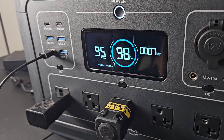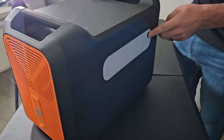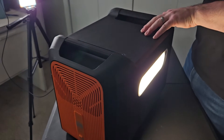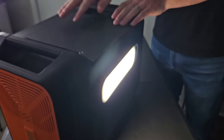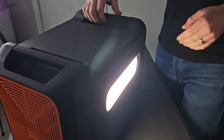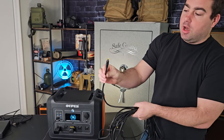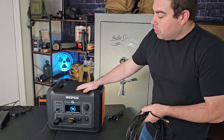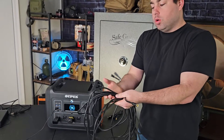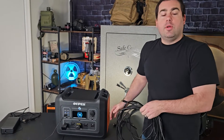It's really good to have a lot of outlets for maximizing efficiency. Another cool feature is the built-in light on the back. I like having a light on the actual solar generator because it's more efficient than plugging a separate light in and running the inverter. This light runs right off the battery, so you get a ton of run time and it's bright enough to illuminate a whole room. I also like having solar extension cables — these come in 7909, Anderson, or other connectors. I run my panels outside and keep the solar generator inside, using 30-foot extension cables through a window to keep the panels charging outside.